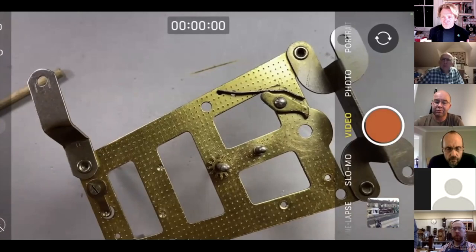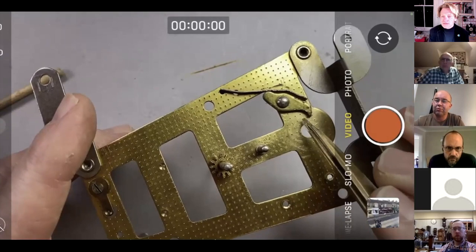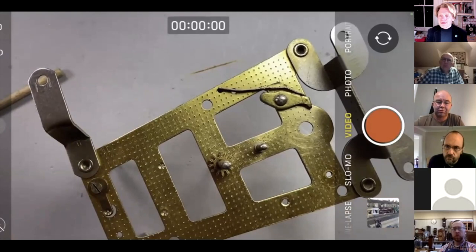I suppose they've got a longer spring here. Well, you can see this spring's been manipulated by a pair of pliers. And the killer thing, when you first assemble any spring-driven or weight-driven clock, is that the ratchet click mechanism must be nice and positive. If it's not, it's going to cause you a problem.